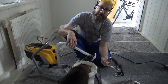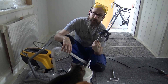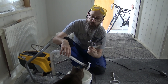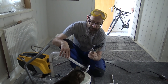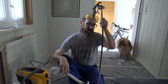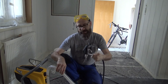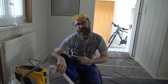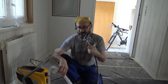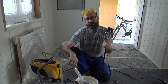What I want to do is put the uptake hose into this fresh water, then spray it through the gun. When I can see the water is spraying through the gun, I can switch to paint. The hose itself is nine meters long, so there's nine meters worth of water in it — I want to spray that back into the water container, and when the paint starts coming out, I put that into the paint. At the end I want to empty all nine meters of paint back into the container too, so we don't waste anything.